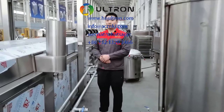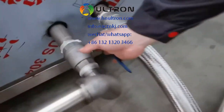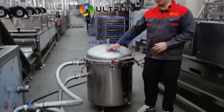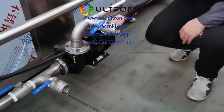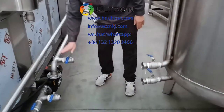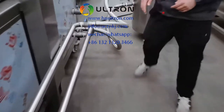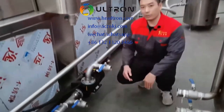When the daily frying work is finished, you need to pump out all the oil into the oil tank. First, close this valve, then open this valve and this valve. We also need to stop the vacuum filter and close this valve and close this valve, then power on the pump. When the cleaning is finished and you need to pump the oil back, close this valve, close this valve, open this valve, open this valve, and open this valve, then power on the pump so the oil will be back in the fryer.